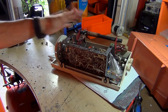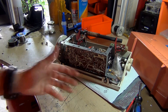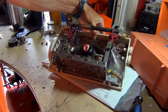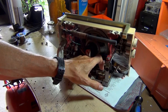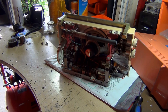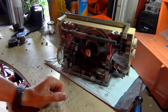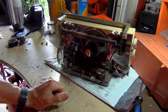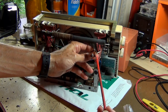To summarize what I think is going on: originally I thought it was the passive components, and I needed to replace those in any case because they looked pretty bad. Now I have a suspicion it may be the transformers. I'll do continuity tests on the transformers and probably pull them out of circuit to get a clear indication of whether there's a problem with them.